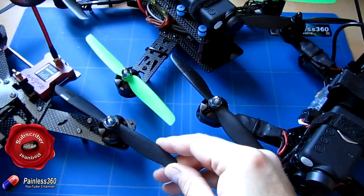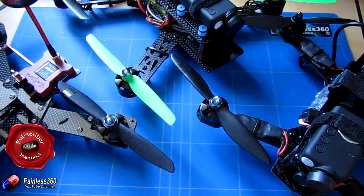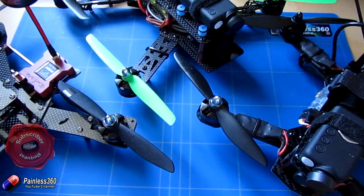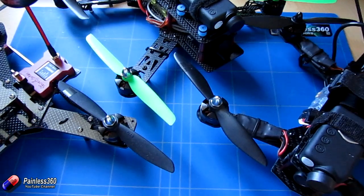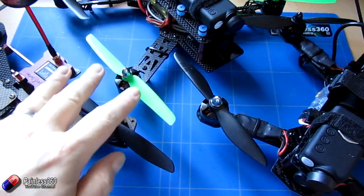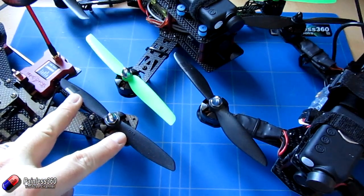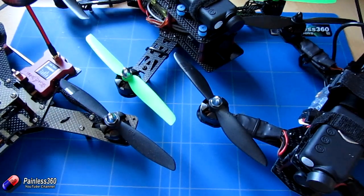Now they all are using slightly different size props, and I'll talk about that in a second. I've had a subscriber request asking to give a little bit more information and do a little review of these motors. And as I'm such a fan and have used them all over the summer and put all of these models through their paces, I think it's about time that we talk about what these things are like to not only set up and use, but to live with day to day. It's worthwhile going through each of these models in turn, because I'm using everything from a 6 inch prop with a 3 inch pitch up to a 6 inch prop with a 4.5 inch pitch, and getting different experiences.